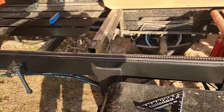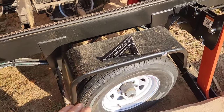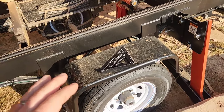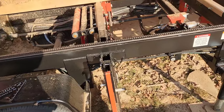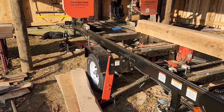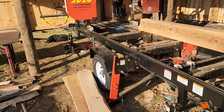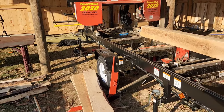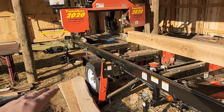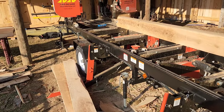You also want your wheels up off the ground. This wheel here is touching a little bit; I believe the other one is off. By keeping those wheels off the ground, it does help keep down some vibration — you can get some weird vibrations. Over time, sawdust and wood gets underneath there, so it's not a must-have, but it can influence some type of bending moment on your structure. It's best to point-load where she should be point-loaded and not where she should not.